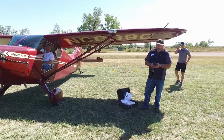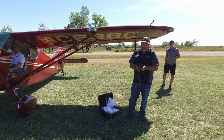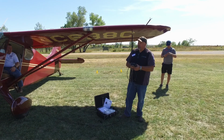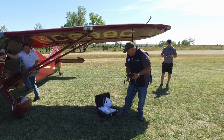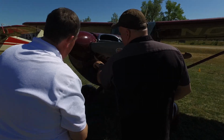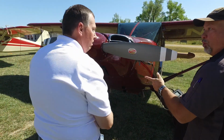Okay, so on that run it was 0.26 IPS, and it's asked for more weight on bolt 5. So it wants another washer on bolt 5. So 1, 2, 3, this is 4 that we can't use. This is 5. So let's add a washer to bolt 5.